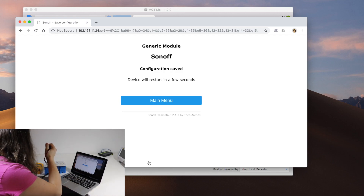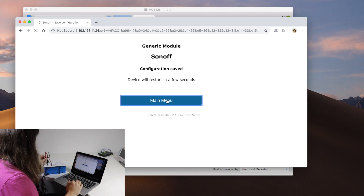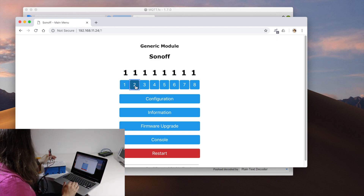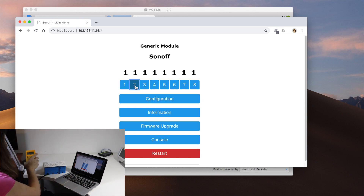Let me make sure I didn't hook this up backwards — I'm going to put on the multimeter. Turning off outlet 1, it goes to 0 volts, or pretty low at least — it's jumping between about 1.8 and 4 volts. I turn it on and it goes to 120 volts. Looks like I got them all lined up correctly. If you are unsure, you can go through and test them one by one. I was looking at the wires as I put the outlets in their places, so I was pretty sure I had it right. I hope you enjoyed this video — if you liked it, go ahead and give it a thumbs up. Be sure to subscribe so you don't miss out on any of my future videos. Thanks for watching.